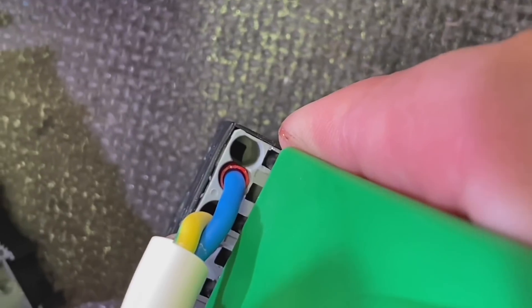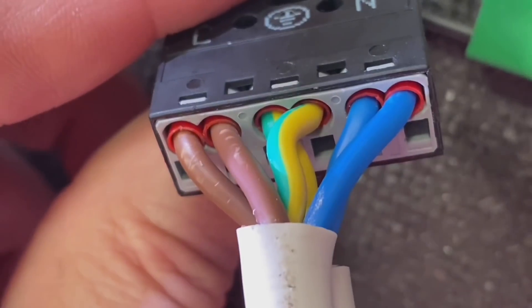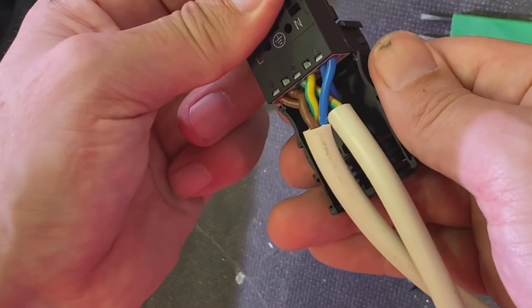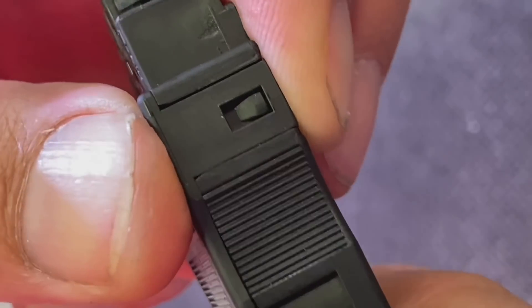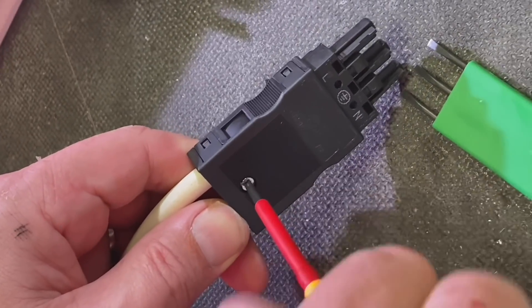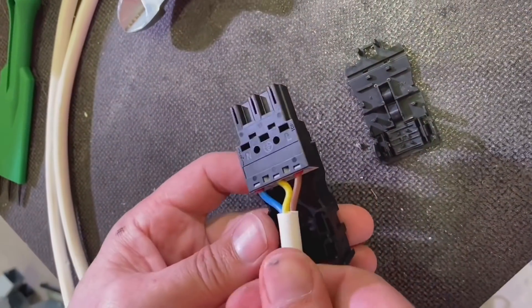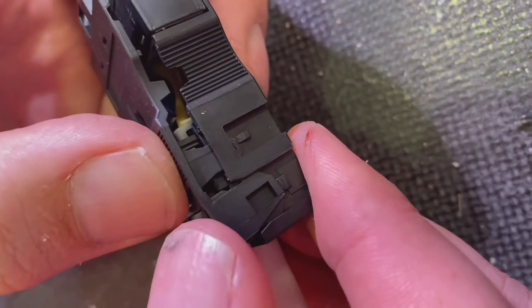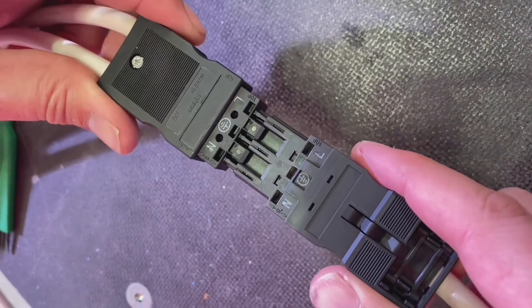Let's run through assembly again: cage terminals are closed, bring in the mystery tool to open them, insert conductors, remove the tool — closed, connection made. Then bring in the body to complete the connector — remove the end cap, push cables into place, latch the top on. You'll hear it click. Tighten the cord grip. On the other end, same principle: special tool in, no screws — click in the body, latch the top, and the ratchet cable clamp mechanism clicks into place.